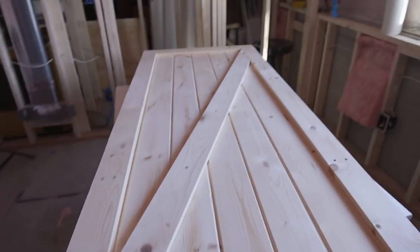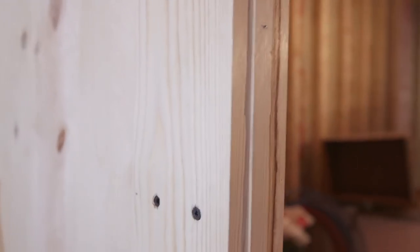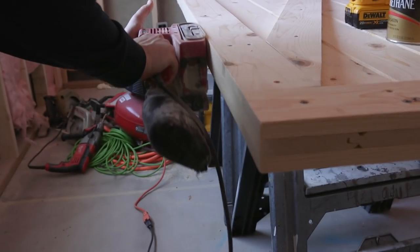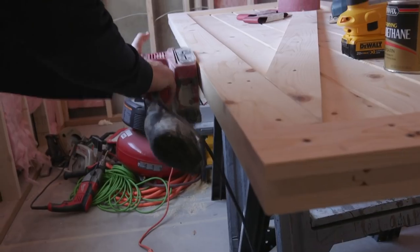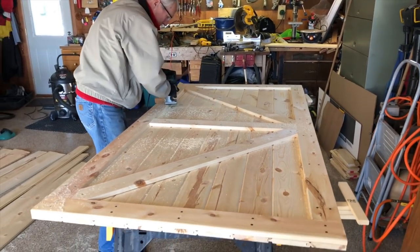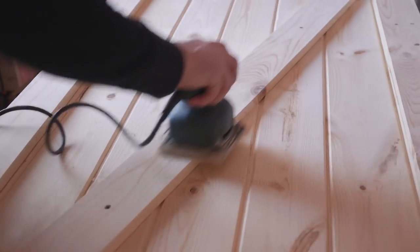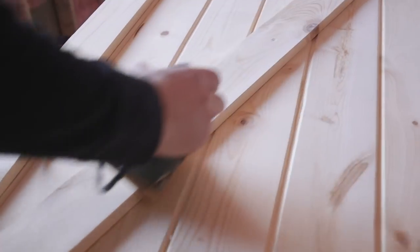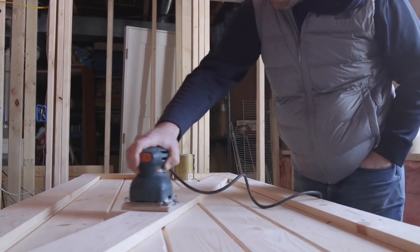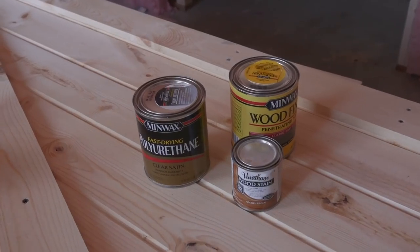One of the last steps to get a really nice smooth finish and clean up the door is to use a belt sander, then come back with a hand sander for everything in between. My dad and I used a router on the door frames in the middle — you don't have to use a router, a palm sander to smooth the corners works too. I recommend giving a nice sand with 120 to 300 grit sandpaper to smooth the door finish before staining and varnishing.